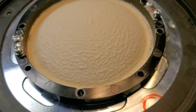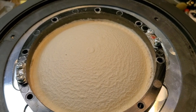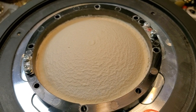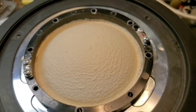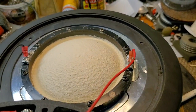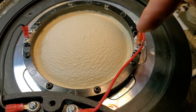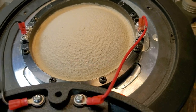I'm going to put this back together and sweep it so you can hear. I've actually swept these before and put them on the internet, and you can hear the secondary resonance light up much louder than the fundamental. Let me get it all put back together and then we'll do a sweep. When you install a diaphragm, you want to do a star pattern on the screws to make sure they're torqued down evenly. You don't need to over-tighten them — it doesn't take much.